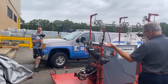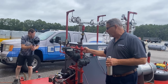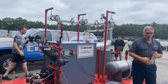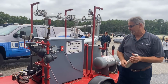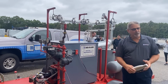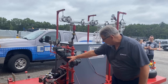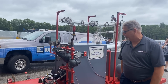We've got 2 low water cutoffs. This is a commercial boiler, so you always want to have your low water cutoff / pump controller, right? So I'm also controlling the feed pump on the reservoir, so I only get water when I need it. Then I have my backup low water cutoff, which is typically manual reset, which I don't think this one is, but you would typically have a manual reset backup. So if this fails for some reason and the water keeps dropping, now I get to, you see the water lines on the low water cutoff, one's slightly higher than the backup.